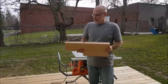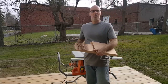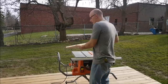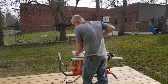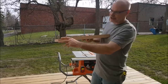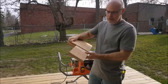All right, there you have it. The angle I was shooting for — my blade apparently isn't quite an eighth of an inch — left a lot of these flimsy little pieces. I'm hoping they'll just knock right off — and yeah, they knocked right off. You can see I don't have a lot of stepping on this surface because I tilted the blade to the correct angle, so I don't think there's going to be a lot of sanding to do.